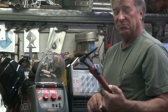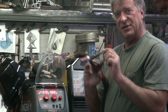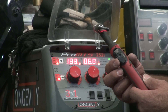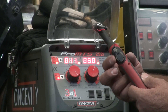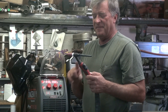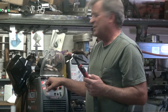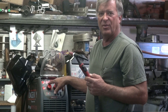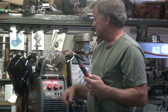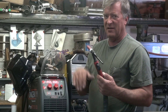The TIG torch — some guys like to call it a club because it's pretty hefty. It's a good size and fits my hand well. It's a flex head, so you can adjust it wherever you need it. It's got an on-off start-stop button, and a rotary amp control built right into the handle. The control on the torch goes from 0 to 10, and it works only as high as your maximum amperage set with the knob on your machine. Right now it's set to 250 amps — at 0 it's down to 10 amps, and turned all the way up it reads 243 amps indicated. Set your max on the machine and work the range on the torch — a little hot, a little colder, whatever you need.